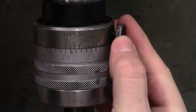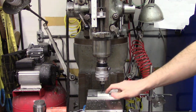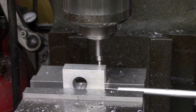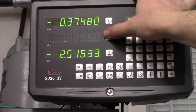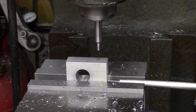Then I adjust my boring head, drop the knee back down to zero, and lower the quill again for the next pass. Once the bore is done, the next step is to drill a clearance hole for our clamp screw. I need to find the center of the part in the Y-axis again since the dimension has changed. I'm utilizing the half button on my DRO again to split the difference between the two edges. I don't need to find the X because I already have the table stop set up against that edge, and I had the forethought to place it such that it would work with the part in both positions.